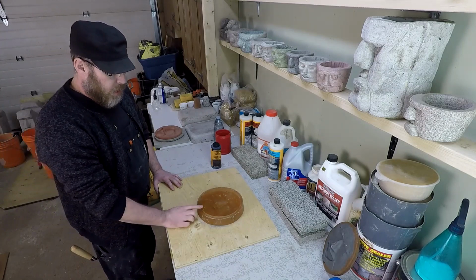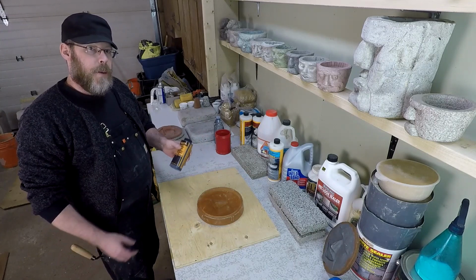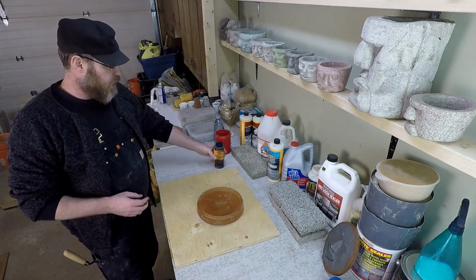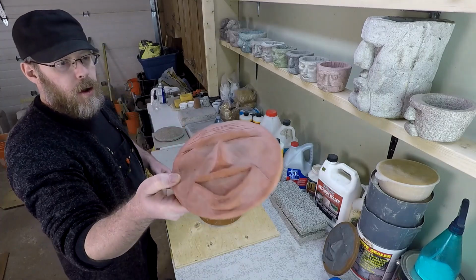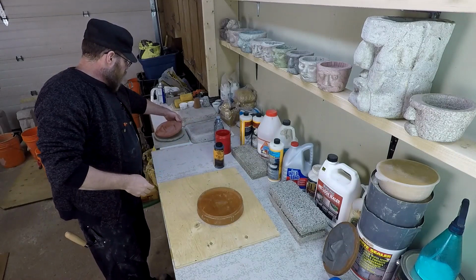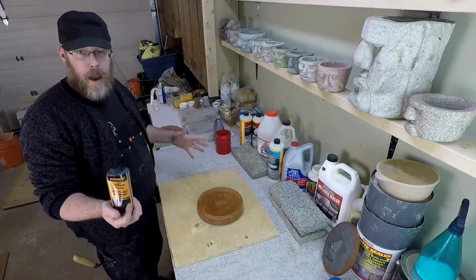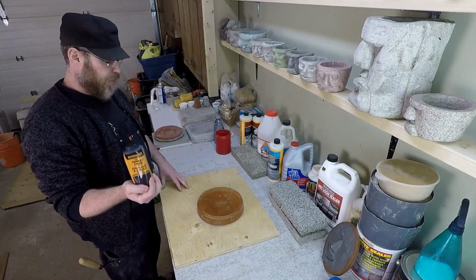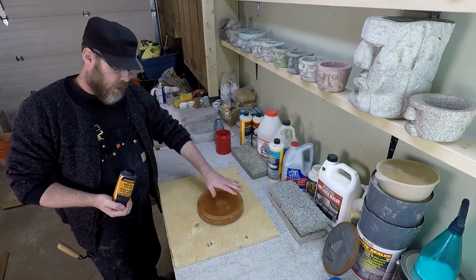So with a 2-to-1 mix and a very small amount of concrete needed, I'm not going to need very much of this stuff. And in a previous video, I made this guy here, and this is from the how to make red concrete video. And I used about 3 teaspoons, about 15 milliliters of this stuff here in my concrete mix that I'm going to make, which is going to fill this.